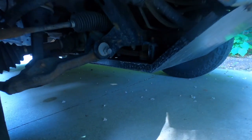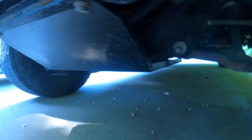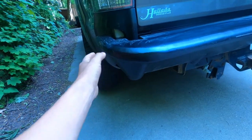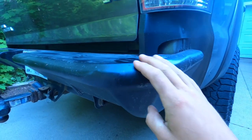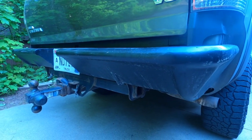The most recent project I made with this welder was my front skid plate. I made it out of eighth-inch steel — lots of welding on this for all the ribs and all the internal supports. And then the biggest project I made with this welder was my rear bumper. It's made out of three-sixteenths on top, welded to 0.120-wall tubing. That welder had no problem welding right into this stuff. Tying it into the frame, it is quarter-inch flat stock — and that had no problem either. So you definitely can take on some pretty good projects with this welder.